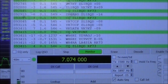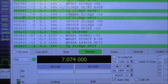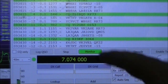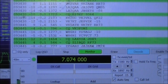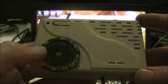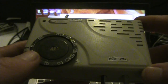A whole load of signals came up that we didn't get before. ZL1BQD, instead of being around minus 4 to minus 10, is now plus 4. And there's signals from all over the world that we're getting, like EI9KF. To sum up, this super simple receiver does allow FT8 to be received with nothing more than it and a laptop, but you do need something else right beside it, like an FT817, to get it on frequency.